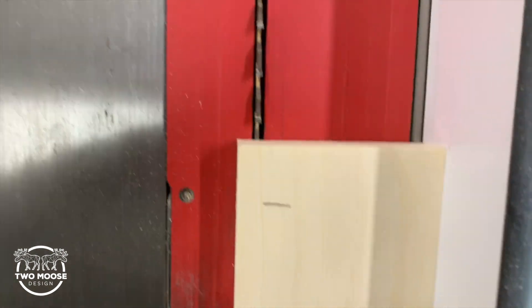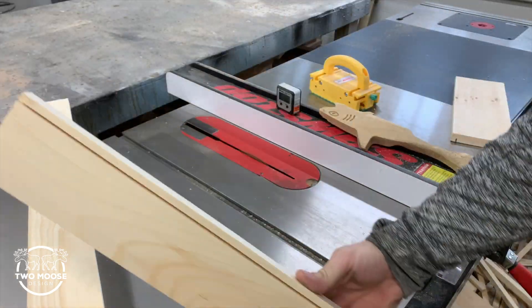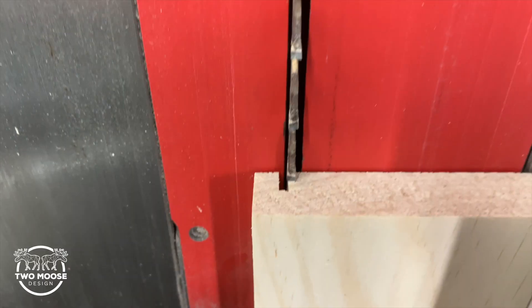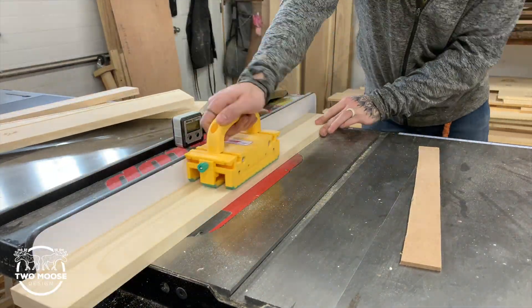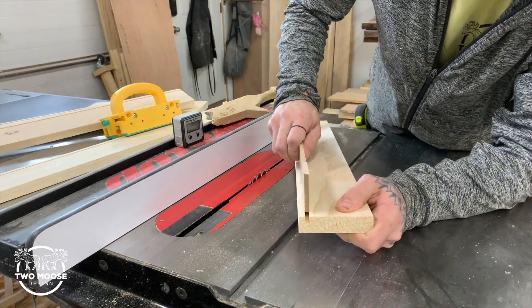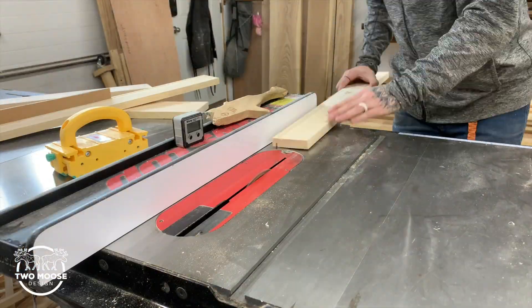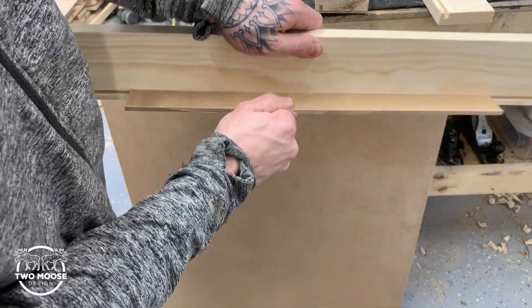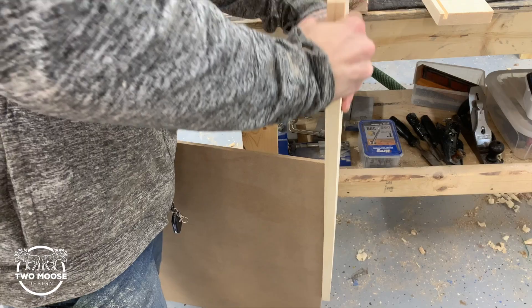Now I'm going to take one of the original pieces, line it up roughly a quarter inch above the bottom, and make the first cut on all the actual drawer pieces. Now that you've cut the groove into all your pieces, slide the fence to take one blade width — but shoot for just under a full blade width because you can always remove more later. If you cut too much it'll be too loose. This is still a little tight for my liking, so I moved the fence just a tiny bit to take out that extra bit and ran everything through one more time. You want the piece to slide in there but still be relatively snug. Here's the MDF bottom piece — I'm going to slide this in to test the fit.